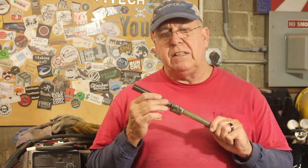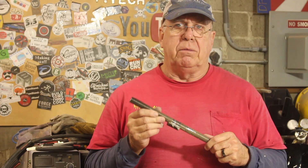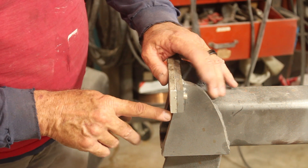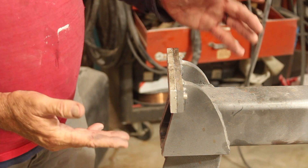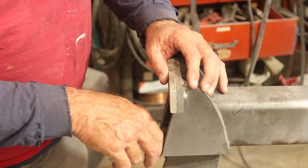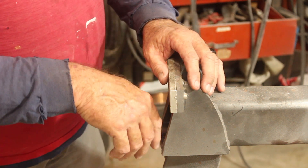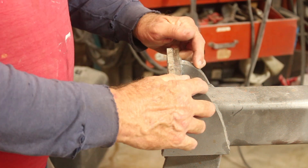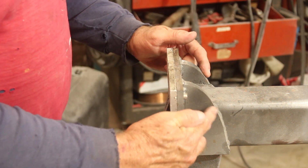To address this issue I'm going to use three-quarter inch, 16 thread-per-inch all-thread that is grade 8 — that's what I'll be replacing this with. Here was another weak point: this angle I got from Jason's design concept looked cool, but having that angle made it so the base of the vice could bend something if it was really long trying to be clamped in there. So we're going to eliminate that in the next rendition.